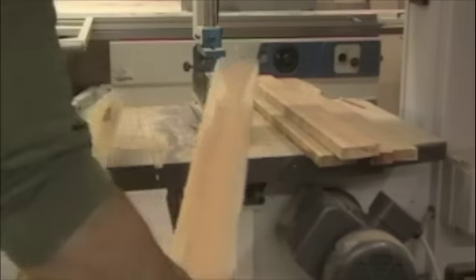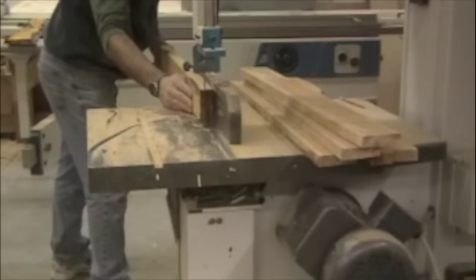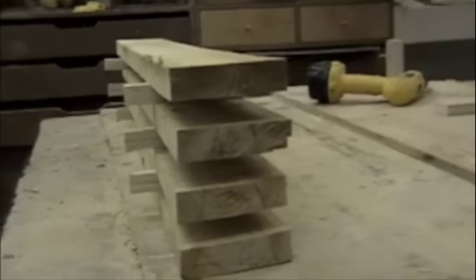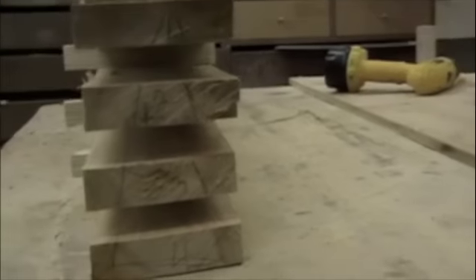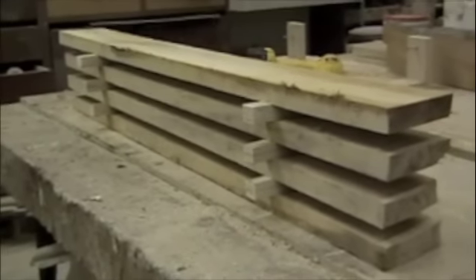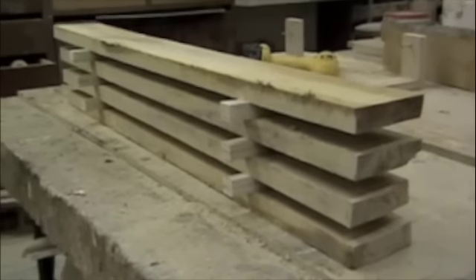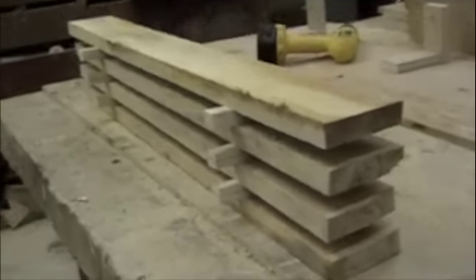As you can see, I've got about four boards cut out. I'm making my final cut here, passing them through. Once everything is cut and ready, I'm going to stack them and have them ready to air dry. Now with the four nice boards cut out, it's important before drying to add a coat of paint to seal the end grain. That's really important — you don't want the ends to start checking and cracking. While air drying, you're going to sticker the boards, which means placing pieces of plywood equally spaced between them to allow airflow. This allows the wood to season properly and slowly, and it'll take about a year before it's fully seasoned and ready to be worked.